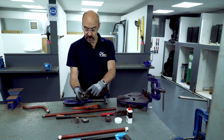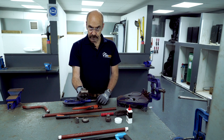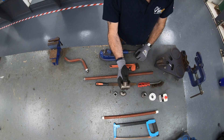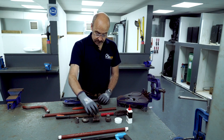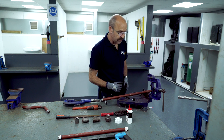Notice that the edges on these fittings have a rounded edge. They are not made of steel — they're made of malleable iron. The beaded edge indicates that they have a parallel thread, and it also adds strength to the end of the fitting. So firstly, I'm going to pop the steel into the vice.